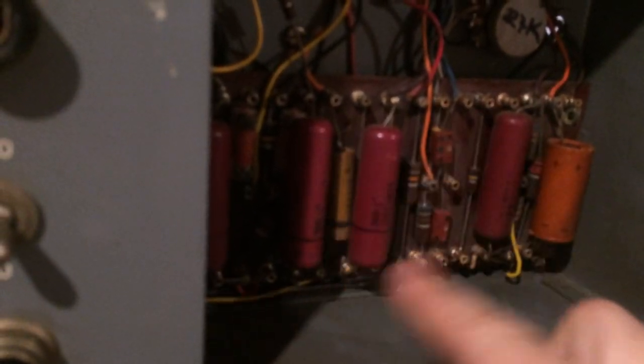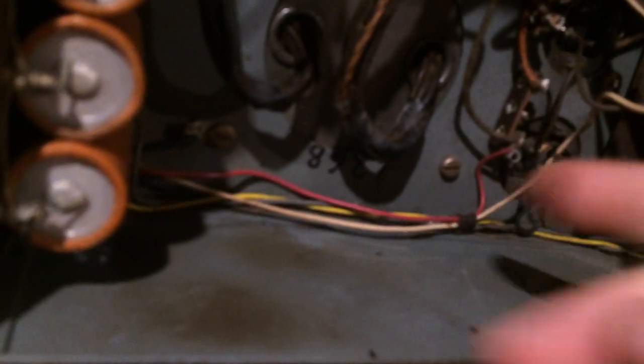If you want to rebuild this, there are a few things that have to go. Basically everything on this board needs to change — none of these caps would I recommend reusing. Upgrading these wires will bring a major change in sound quality — I would say a major upgrade. Look at this really flimsy, skinny old wire; this really limits input current. If you just replace all of these flimsy wires with something heavy gauge, that's mandatory for the rebuild.